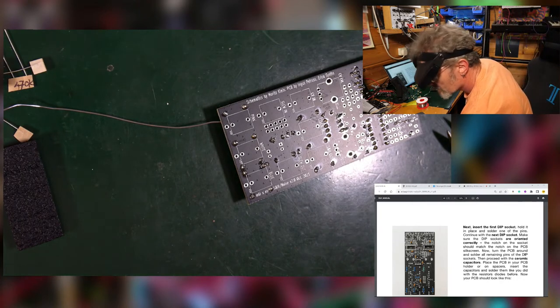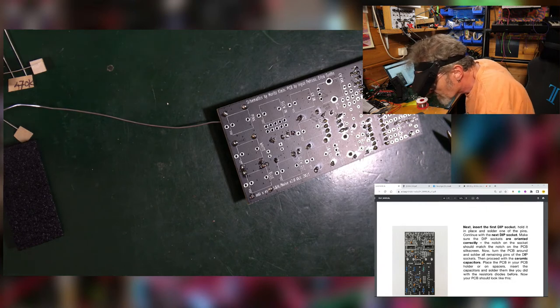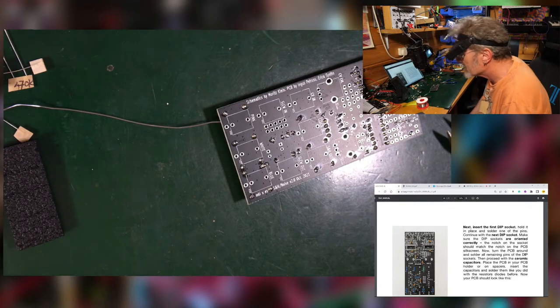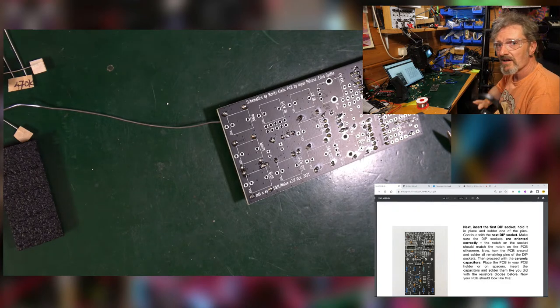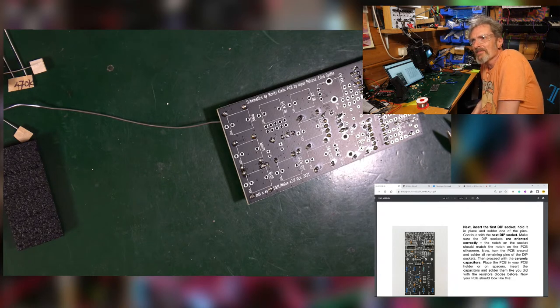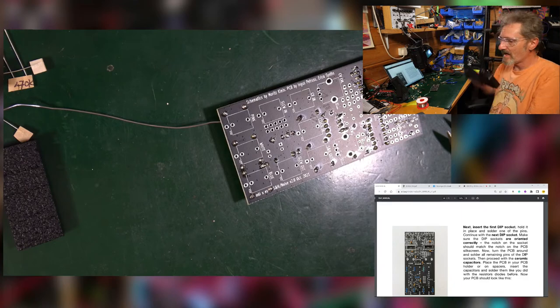The convention is two numbers followed by the number of zeros. So 104 is 10, what then, four zeros? Oh, okay. No, I didn't mean that there's no convention, as in, I know there's a reason why they are what they are. It's the convention of having it as 100 nanofarads rather than 0.1 microfarad. Why not just stick to microfarads, or stick to one? That's all I'm saying.